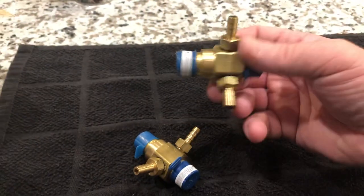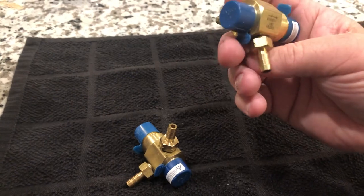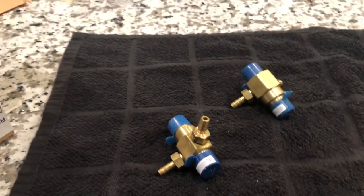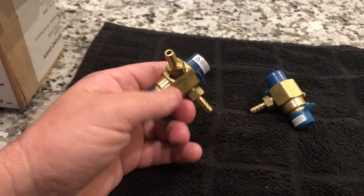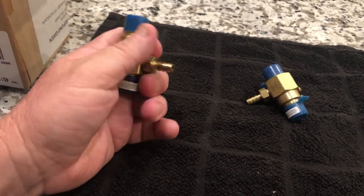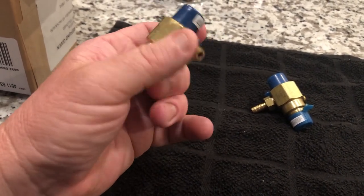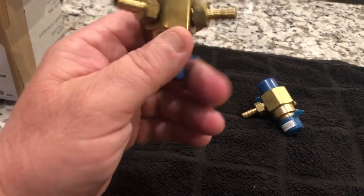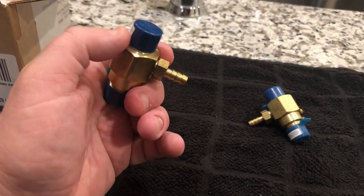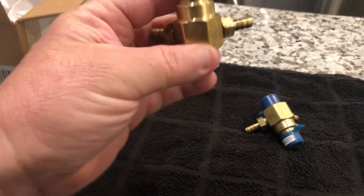So these two are identical. I think they're 20 or 30 dollars each and the draw rate is 30%. If I can throw 3.75% sodium hypochlorite on a wall, that means I get to go home earlier that night. Now, it's probably not quite strong enough to do shingle cleaning — we'll see. When I do my shingles I like between 4 and 5%. I just don't think I'm gonna get there with this, but it would be great if I did. That being said, I might still pre-treat my shingles if I can get close to 4% draw rate, and then come back and hit it with the air diaphragm or a 12-volt.